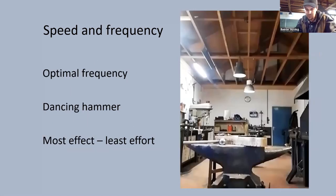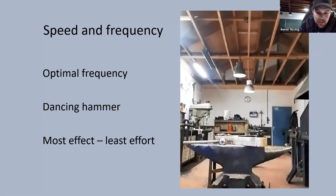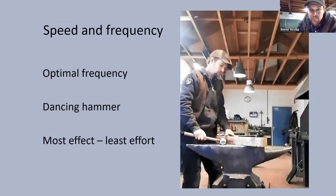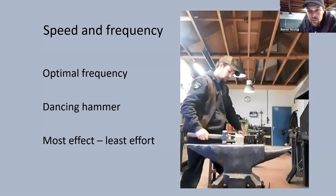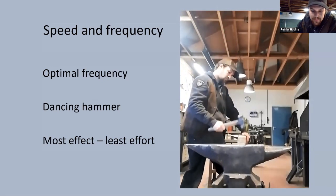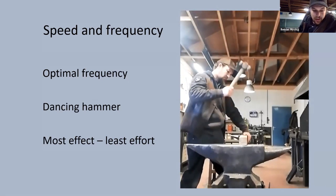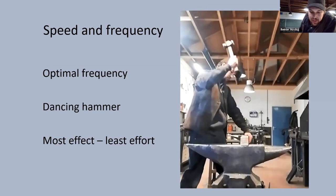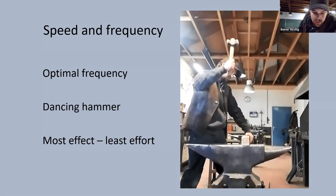What I've seen is that some students can't find the optimal frequency and get tired soon. I then always give them a piece of wood to hammer on, so it doesn't need to be heated and they can keep hammering. I ask them to try a very slow rhythm and gradually increase the speed to very fast, then feel where the optimal frequency is — because that is when the hammer doesn't seem to weigh as much and everything feels easy. I made a video to show in slow motion what happens on a full swing, using a piece of wood for good rebound. This is the optimal frequency, and as my teacher described it, the hammer dances.